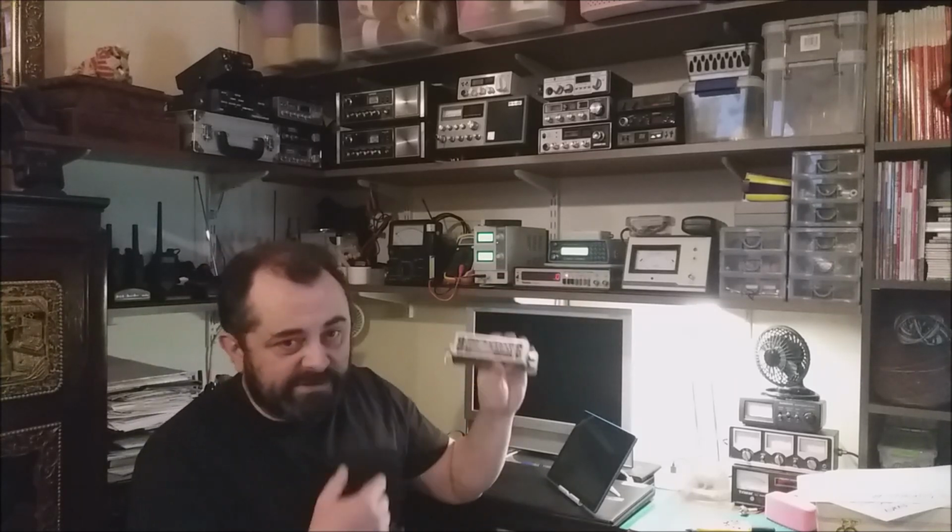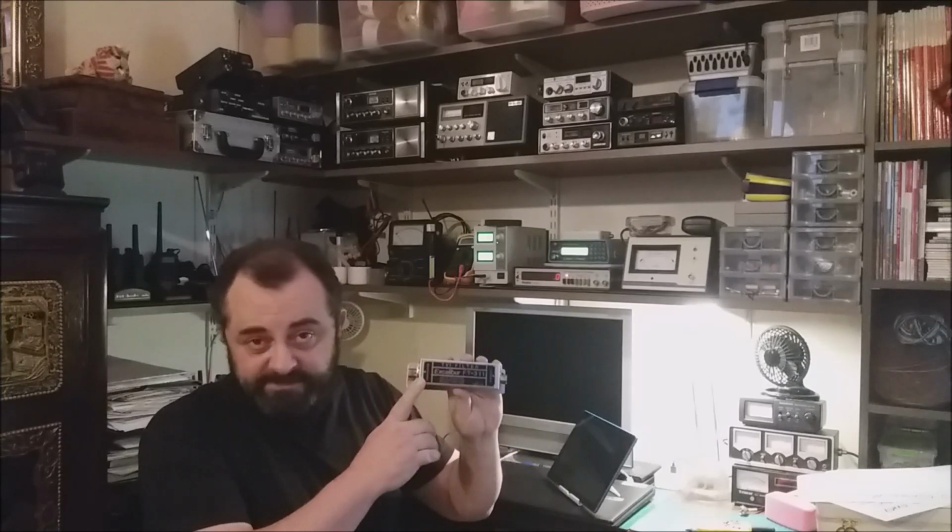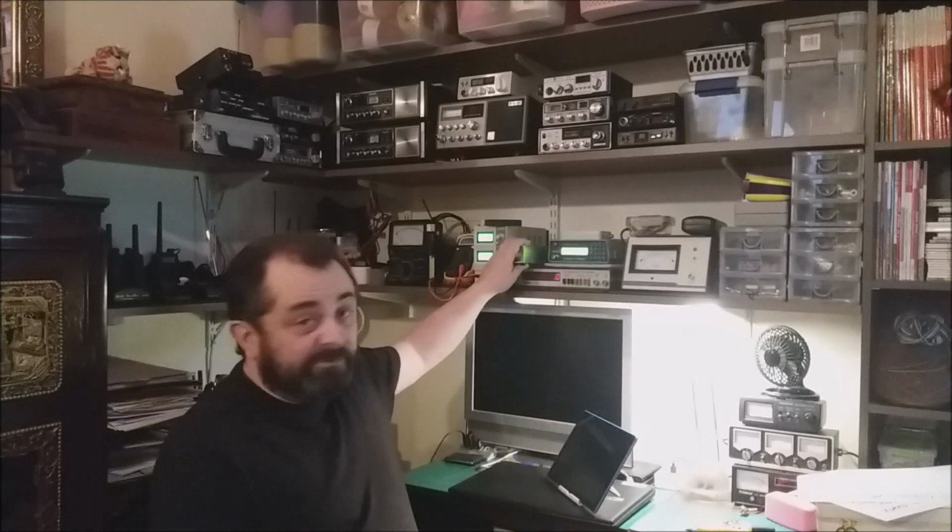I have been told that one of the harmonics, I'll have to check, one of the harmonics from CB 27 megahertz lands in the aircraft band. You certainly don't want to be running a harmonic from a radio that's a little bit out of tune, a little bit out of spec, through an amplifier, and then that's amplifying a fair few watts out on the aircraft band, and that's certainly subject to me double checking that, but that's what I've been told.